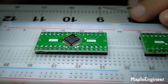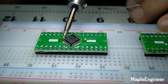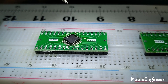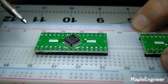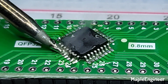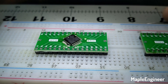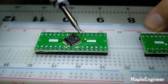I got those ones done, let's get this solder bridge out. I need to clean my iron — pull that solder bridge out. I may actually have to go in there with a bit of wick. Let's do the other side. I'm going to try to be further out on the pads rather than the pins. See, we got a solder bridge there — a little bit too much solder on the iron I think is the problem. Let's try again with a little less solder. Nope, I got another solder bridge — this is more challenging for sure.